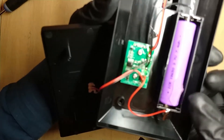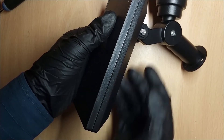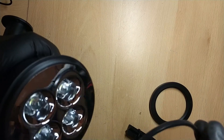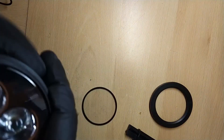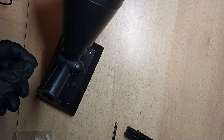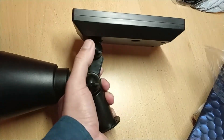For waterproofing: this part is recessed so water would have to go in and then somehow upwards, which shouldn't happen unless it was installed upside down. However, at the edge where the solar panel is there is a gap which could let water in. There's a rubber edge around the glass on top of the screws, which will stop moisture getting through. The reflector has some fingerprints on it — not mine as I'm wearing gloves. The LEDs appear to be large 8mm LEDs — unusual but nothing special. When putting it back there's a cut-out that needs to line up; don't over-tighten. At night on full brightness the beam angle isn't very wide — it only illuminates a small section. A disadvantage is it has no PIR sensor, meaning it will be on all night, and you can't angle the solar panel and the light independently.